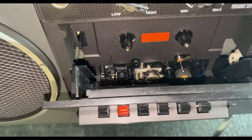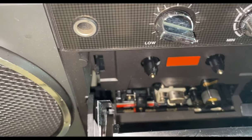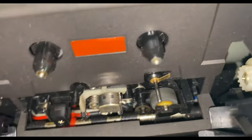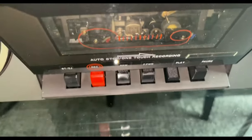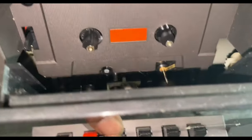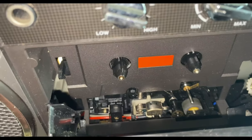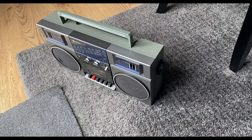Okay, so looking at the cassette - it's not working apparently. I'll just press play here, nothing's turning. You can see the capstan in there and the take-up reel's not moving at all. I'll try rewind - not turning either. There's obviously a problem inside, more than likely the belt's gone. I'm gonna have a look anyway.